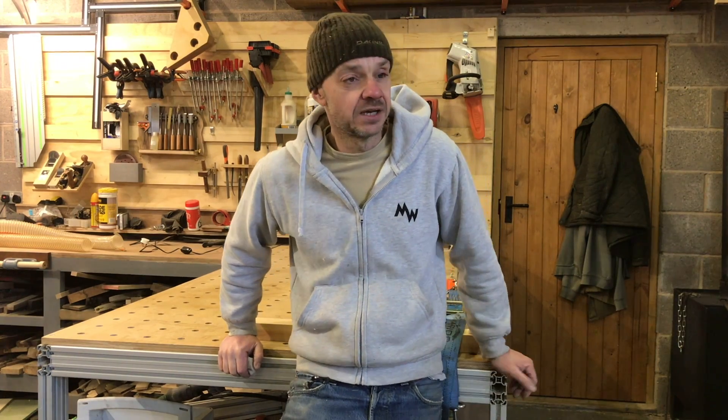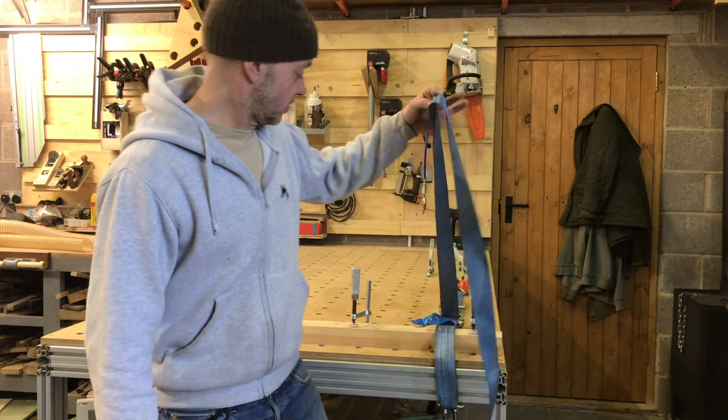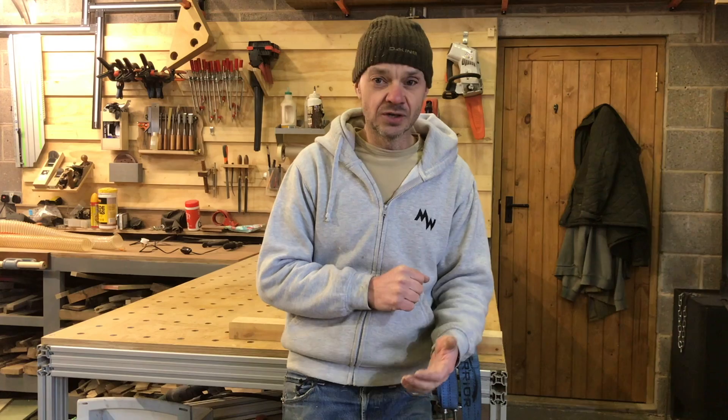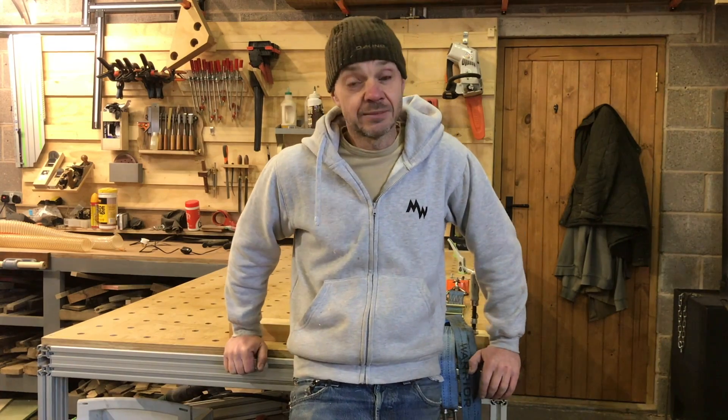I didn't want to get more technical and start rigging up threaded bar - I looked into it and it's just a right faff. What I did was switch to a really good ton-and-a-half to two-ton ratchet strap, and I can get some serious, more consistent pulling on that. There is a bit of jerk as you're clicking it, but I think that's probably good because it's really putting stress on the joint. I've had some really interesting results to share today with just glue, Tight Bond 1, ET500 resin with Tenso, Clamex, and a combination of Tenso Clamex and the Domino.